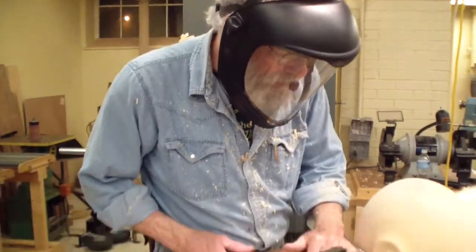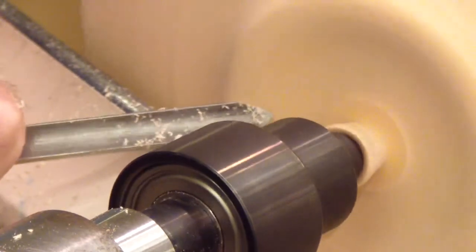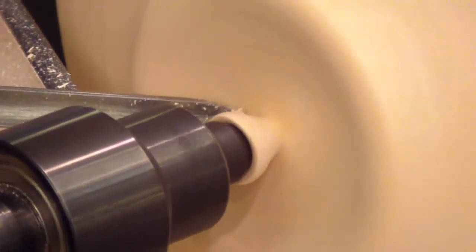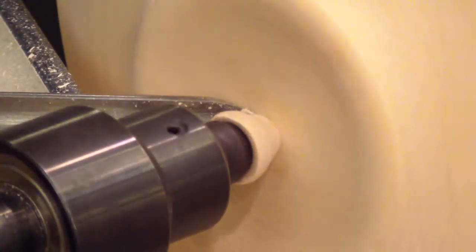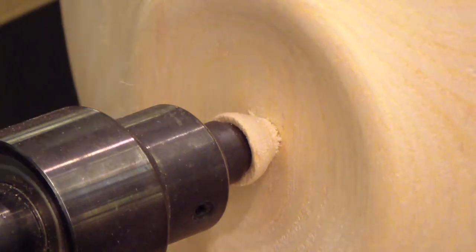So we'll trim that stem down now, taper it, then get on the bevel, and guide the bevel down on the surface, and then empty the material like that and cut a concave here. Then taper that stem down again, get on the bevel and take it down. Last track, turn the machine off and just advance that forward, and it should, there we go, cut right through that thing, to finish that off.